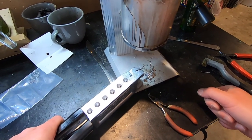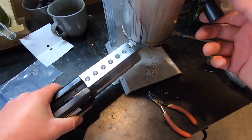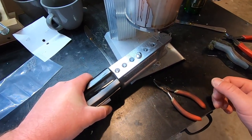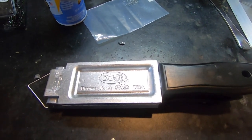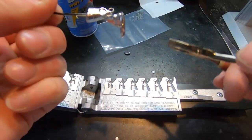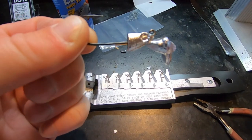Over here at the lead pot we're going to pour our first jig head - the middle one. Just put it underneath the spout, pour it inside, and hopefully we get a nice clean pour. We have our lead in there - opening up the mold it looks like we got a good pour on both sides. This is our first quarter ounce jig head. We'll set this aside and make four more.